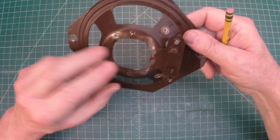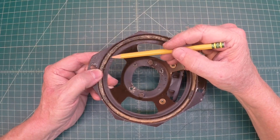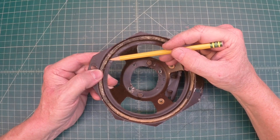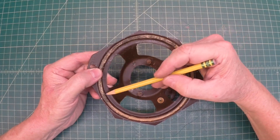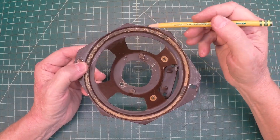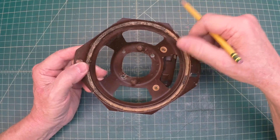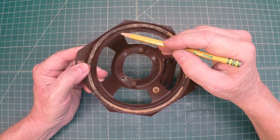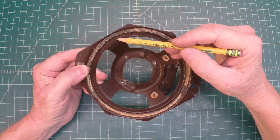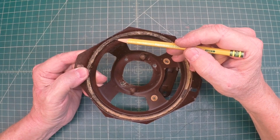Let me pull the frame over here. I did another dry fit after getting the cone out, and I think I still have enough room. We'll have enough adherence here to get the existing cone back to the frame — it'll be a little tight because we lost a little bit, even though I tried to loosen up the glue. But you can see where it was down pretty well. I think we'll have enough overlap that will be good. I'll look to increase the size of my gasket ever so slightly to give us a little bit more overlap, but not take away from the performance of the speaker.